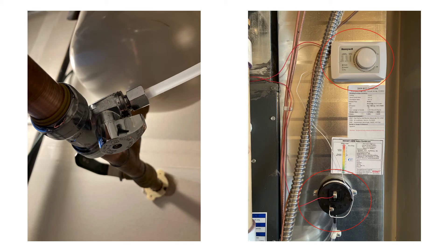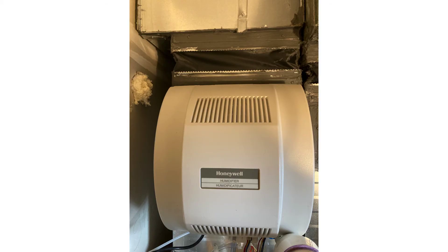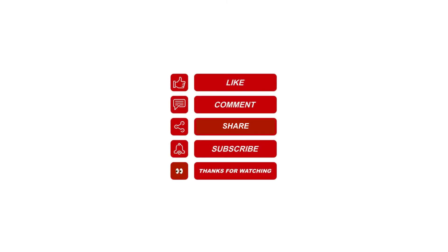The installation is finished. Ideally, set your humidistat around 50% humidity for comfort. Anything much above 50% can become uncomfortable and you may start to see water condensing on your windows or walls, which you don't want — it can lead to mold growth. Below 50%, the lower you go, the drier and more uncomfortable it will feel. I hope this information helps. Please like, share, subscribe, and leave a comment for future video topics you'd like me to cover.